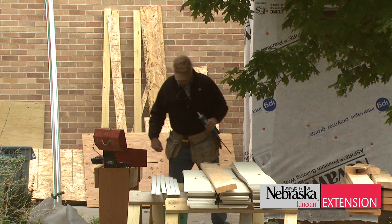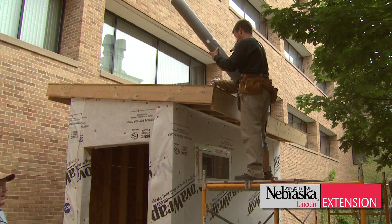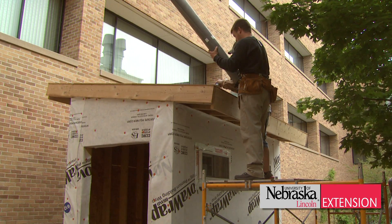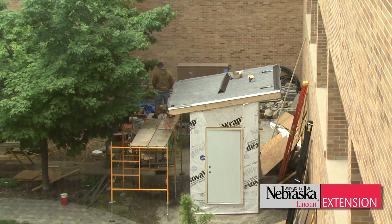The building, however, has to sustain the weight of a fairly heavy roof. I estimate probably about a ton and a half of weight on top of the green roof. It's all two-by-six construction — the joists are two-by-six, 16 inches on center.